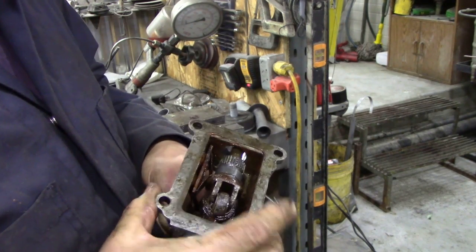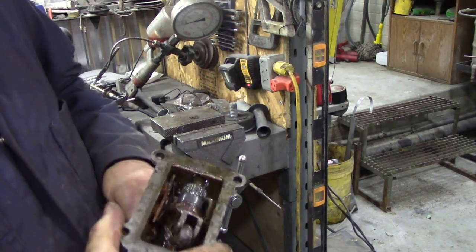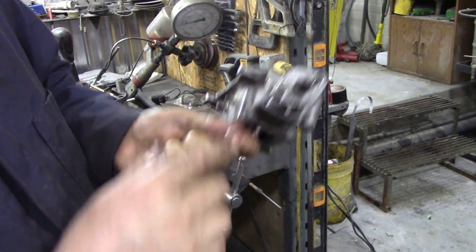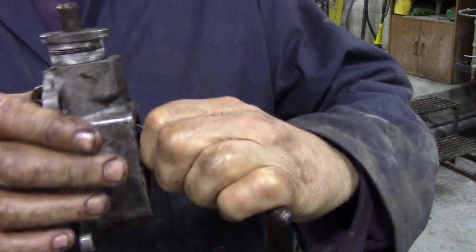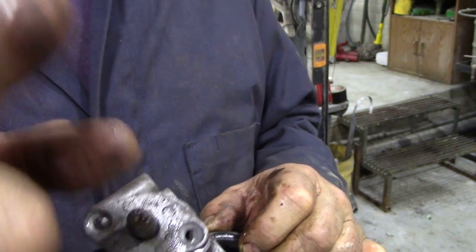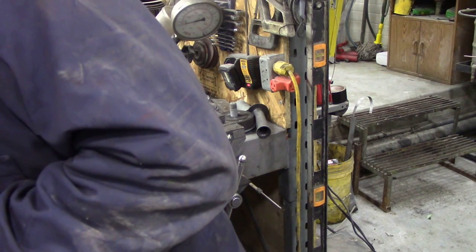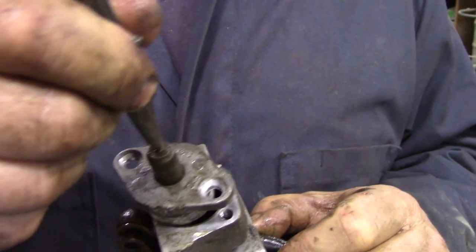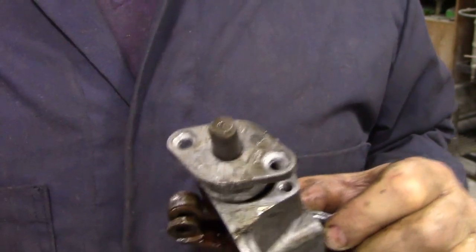We can give this a bit of a buff up, wind it backwards and forwards, and we'll eventually get all that to pieces. You can see it's all coming out - it just takes a little bit of time. We've got to get this piece out before we can get this piece out. I'm going to clean this up on the wire wheel and then tap this shaft down. When you tap shafts down, use a little punch - this one's got a little centre dimple in it so you could use a centre punch and tap it down. The reason is, if you go like a bull in a china shop and start hammering, you can peen over the end of the shaft like a rivet and then you'll never get it out.